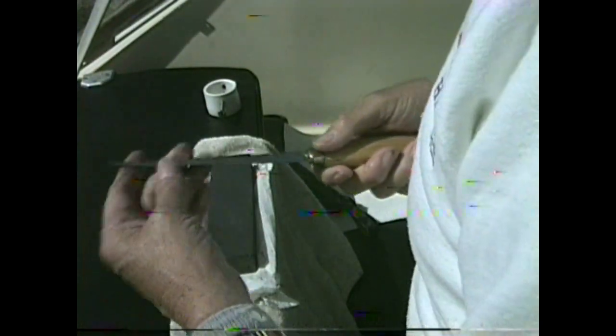A little bit more oil on there. WD-40 is a good cutting oil — you can actually get cutting oil from the knife shop, but most anything will work. I'll make sure the stone and the blade are grinding against each other. Now I'll turn it over. I never look until I've ground two times on each side. On a knife that is really dull, I don't think I've gotten down to the point yet. I'll find a burr down there — getting a little bit of a burr means I've ground past the roundness on each side, so I've got to do just a little bit more, keeping a solid grip and fairly light pressure as I move my hand along.